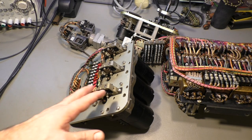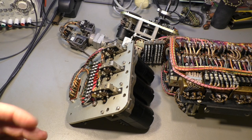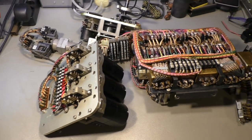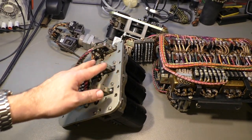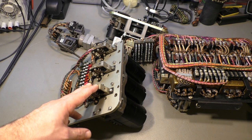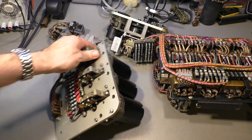This will tell the propeller governor to move the propeller blades a little bit, because the governor itself is made to maintain a selected speed. So if the speed changes because the engine gets a little bit more gas or the air gets thinner or thicker, the governor will change the propeller blade by itself to maintain a constant speed. But here, with these adjustment switches and the adjustment stepper motor on the governor, you can change that setting a little bit to match, so that all four engines are in the end at the same speed.